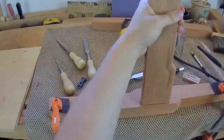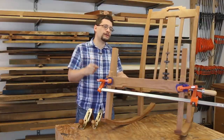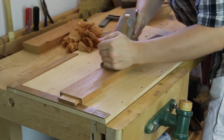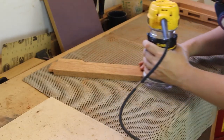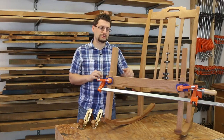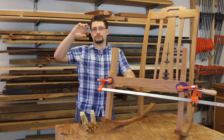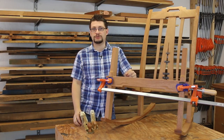For starters, I got the sterling silver placed into my ebony bars, and that was a lot of fun. I used my jeweler's saw to cut the silver at the bench, holding it into my tail vise. Then I went ahead and super glued every single one of my pieces of silver in, and brought that down to its thickness — just a little bit thicker than the ebony — with a file. Then after some final sanding with 220, 320, 600 grit, and then finally a buffing out, this is what you get.